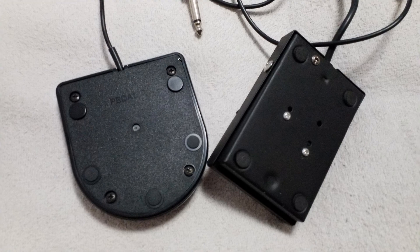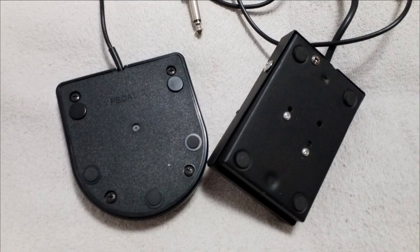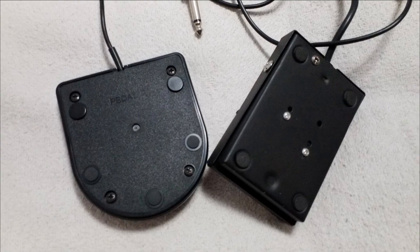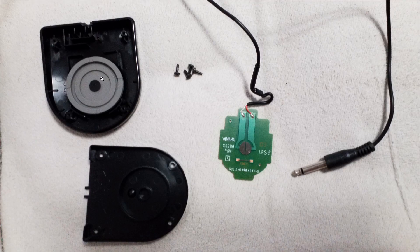To disassemble them: this one is a simple foot pedal. It just has screws on the back and you can get into the internals. This one is a little more interesting. If we look at the front of this one, it has a push button, so the back of it is just closed. But this one — the entire case shifts. This screw is actually a pivot, while these other screws are holding the back on. It's controlling how much it can open and close, and it's spring-loaded.